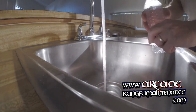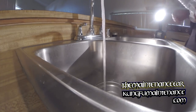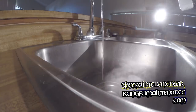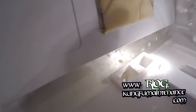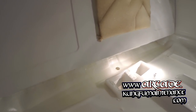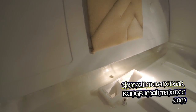Now we're going to take our hot water, turn it on — good and hot, you can see it steaming. We'll fill up our water bottle and squirt the stream right down the condensation drain line. The part where most people get stuck with this is that they stop too soon — they might see a little bit of water go down and then stop. You want to make sure that it actually drains, and then after it drains do it again to make sure it really drains. Sometimes you think you got it and you didn't, so this is something you may have to repeat.